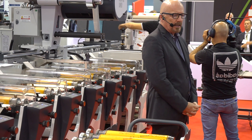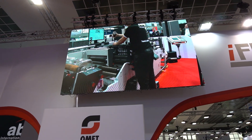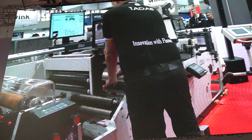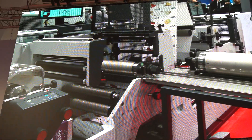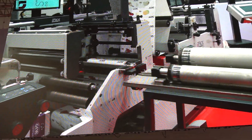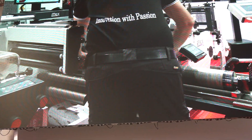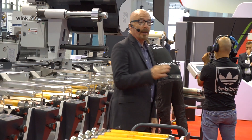For a completely die-cutting changeover — very simple — it's our easy-change die-cutting unit. Tadas disengages the 12-inch cylinder of our first job, opens the die-cutting station, and takes the easy-change cart with a 20-inch magnetic cylinder, which can be prepared offline while the press is running. He sets it up in the die-cutting station. You can see just how quick and easy it is to change the magnetic cylinder with this simple sliding device. An operation that used to take 15 to 20 minutes now takes less than 30 seconds, with no need for lifting devices. The iLight laser pointer feature is also on our die-cutting station for quick die alignment.